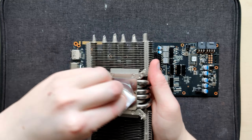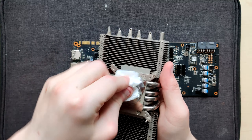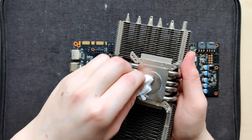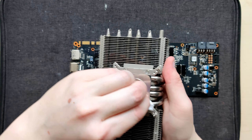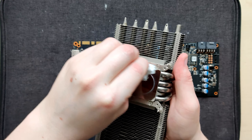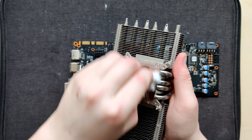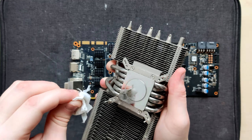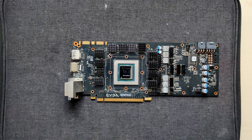I don't see any major issues. I guess let's clean off the core and see if it's shattered or anything, because the edge is not being covered by the heatsink. Yeah, that's not great because you can very easily end up in a situation where that corner gets very, very hot and the chip just burns itself out. Even if it thermal throttles, if you have a bare die that's not covered at all, it's still very easy to just die.